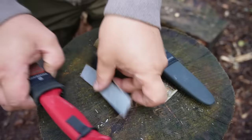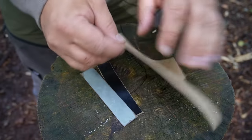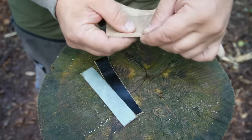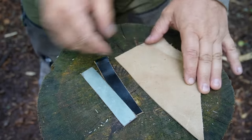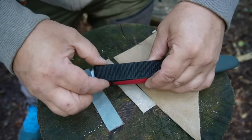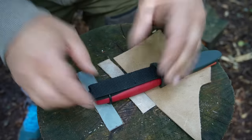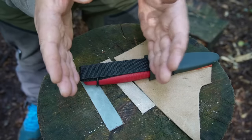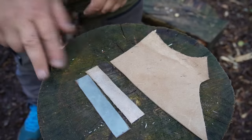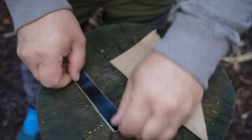These strops I made out of this leather. It has a thickness of about 1.5 millimeters. I just cut some stripes with the width of this sheath band — about 25 millimeters on 125 millimeters, something like that. I made two stripes: one with grinding compound on it and the other one to cover it. This cover side you can use for the super high-end finish.